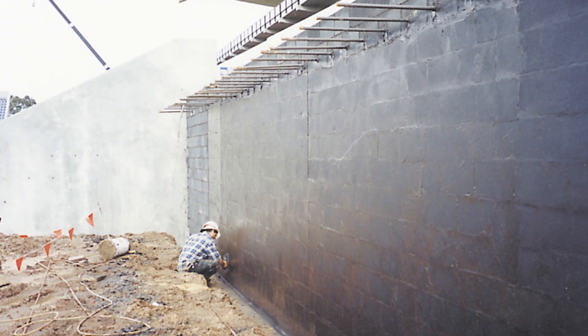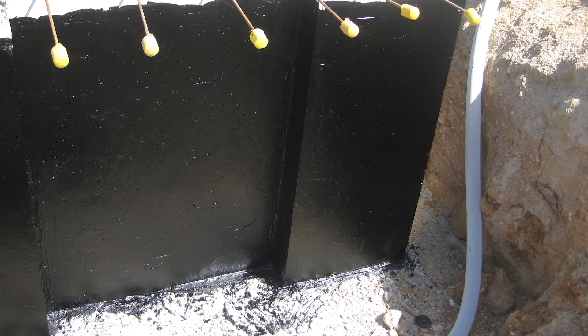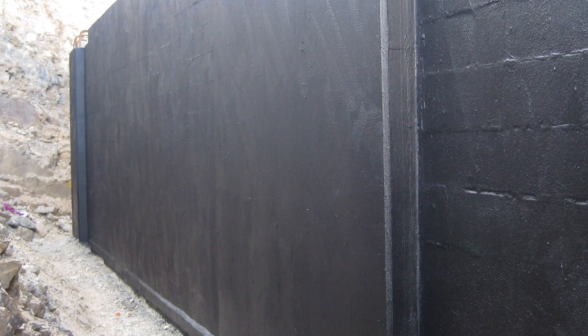The base of the wall is where most moisture sits, where you've got your drainage detail. If you can't get the membrane started properly there, it's going to compromise the whole system, because with capillary action moisture will go in under that footing and up behind the membrane, undoing all the good work you may have put on that wall.